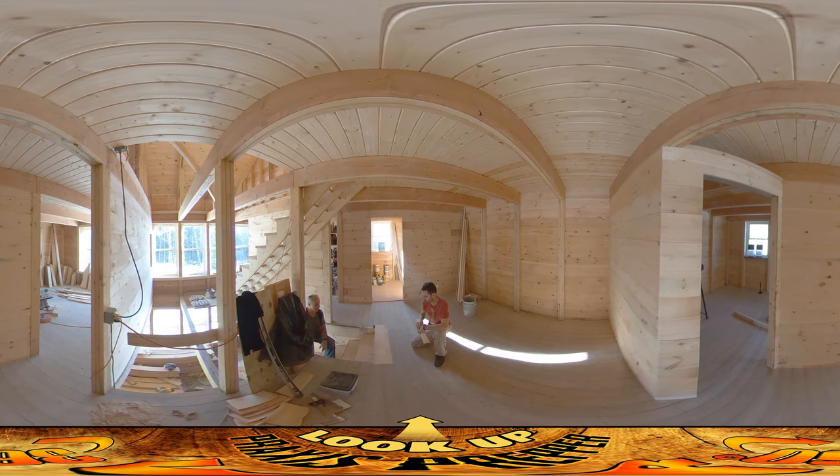I think that's the cleanest way, though I'm still a little concerned about how it's going to work. One concern we both have — my dad actually brought it up — is these floor joists ideally are perfectly plumb, straight up and down. But if the floor joists are tilted a little bit and you're keying the railing down into that, it's going to be like you're in some kind of haunted fun house — except it won't be very fun when the inspector comes through.